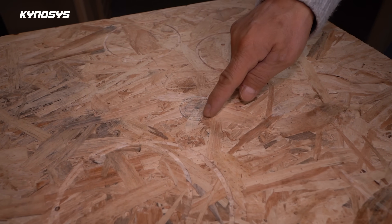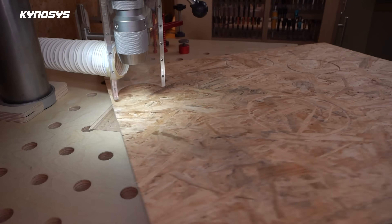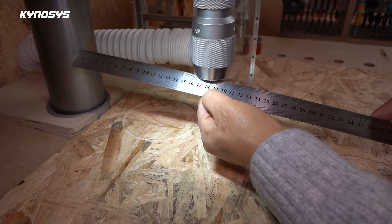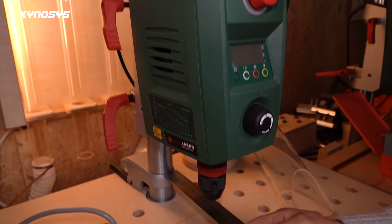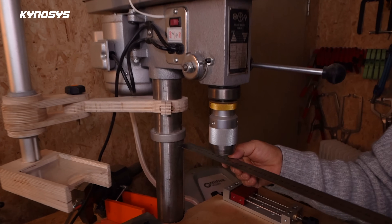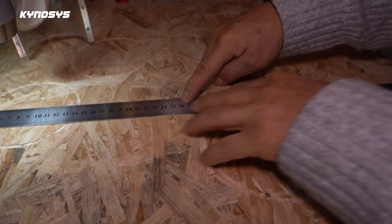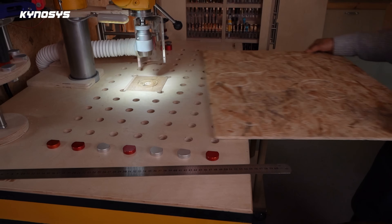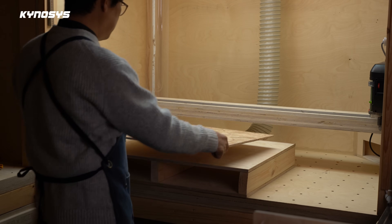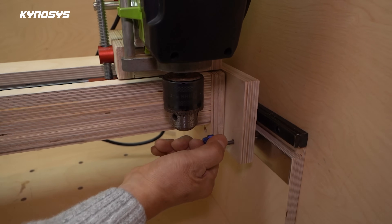It's done. When drilling a hole in the center of a large piece, a regular drill press won't do the job. The distance between the fixed shaft of the drill press and the drill chuck is very short — I measured my drill presses and they are only about 150mm to 180mm. This piece can be used to perform any desired drilling operation, even in the center of a very large wood. This would seem like a very useful item for those who don't use CNC.